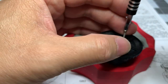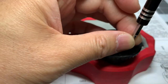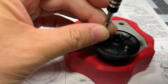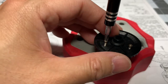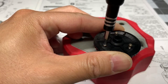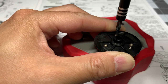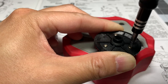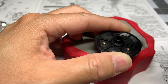If you didn't watch yesterday's video — you don't want to go all the way down with one screw at a time. You definitely want to go in a rotation so you don't put any clamping force onto the gear before it can be evenly spread out. Go back and give everything a final quarter turn, and there we go.